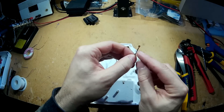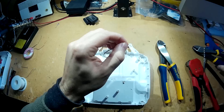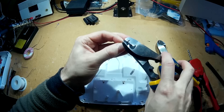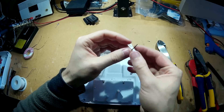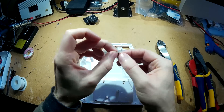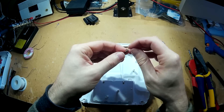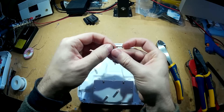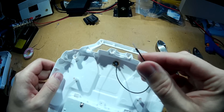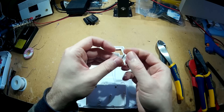Now it's just a matter of trimming the end off here — this is quite a small piece of wire so it can be reasonably tricky. You need to be careful when you do that because you can catch the small piece inside as well. We've got the outer shield here, then an insulator, and inside there is the antenna. You need to make sure that you're not shorting those together, because if not it's not going to work and you'll probably blow your transmitter. Just make sure there are no stray pieces of wire which could short it out.